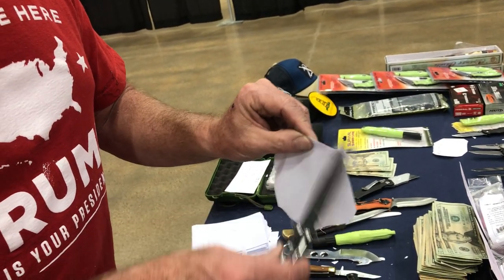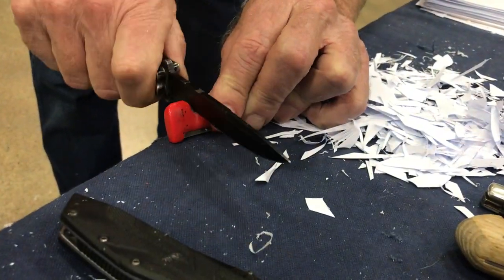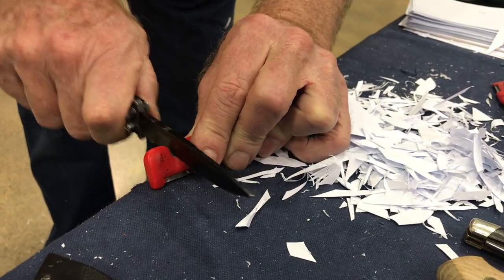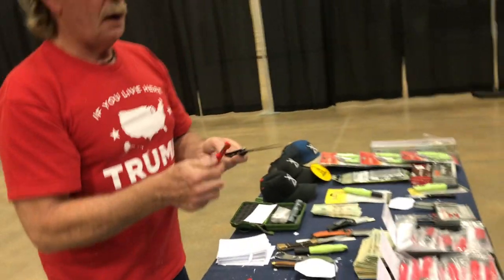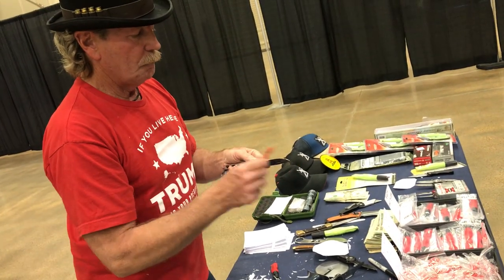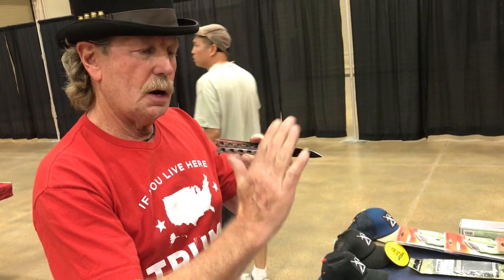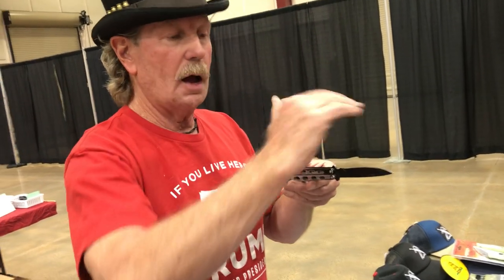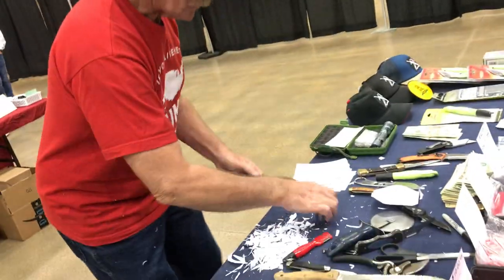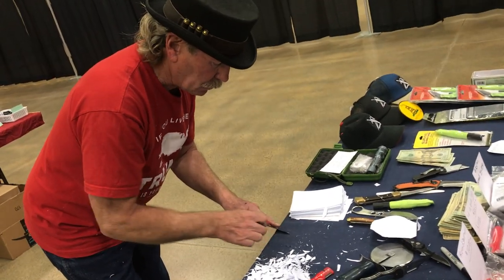It's cutting — that's much better than it was. Let me run it through the V a couple times and recut an edge on it. That's 10 degrees on each side, so it's 20 degrees inclusive, and you'll see some metal coming off. Dull knives will never be sharp if you don't take metal off the blade. The apex of the blade — let's say it's two thousandths of an inch thick — you have to take at least a thousandth of an inch off each side straight to the apex to ever have a sharp knife.